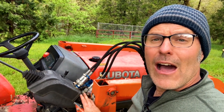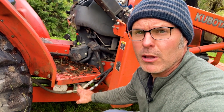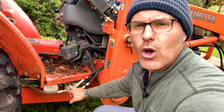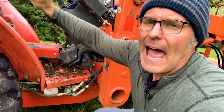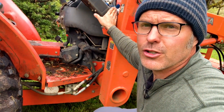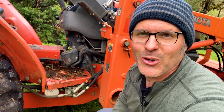On a tractor without backhoe connections already, the hose marked green runs down to the manifold to the green port. Since we have a backhoe plumbed in, that hose goes back to the backhoe and the backhoe returns fluid to the green port. If you're installing this without existing backhoe connections, a hose runs back to the pressure port of the spool valve, and out of the spool valve a hose connects back to the loader valve. It comes with pictures in the installation manual.